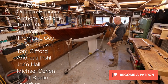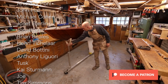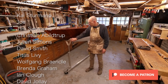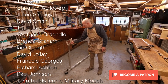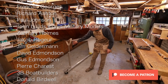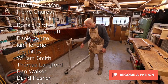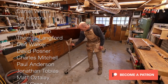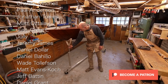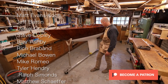So they drop the boat onto it with a crane. And of course, we've got a simple yoke up forward here. It's got aluminum inside, and we just used some fire hose to create a sling that's going to cushion the bow. I wish this was a little further back, just below the waterline. That would have been better, and maybe they'll modify this in the future, but for now that's what we've got. We've used a couple of eye bolts through this piece of tubing that locate this thing in place, so that works pretty good. It gives us some adjustability, and we're just at the top of the range, unfortunately.